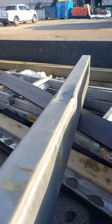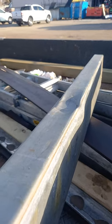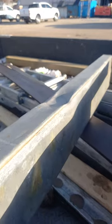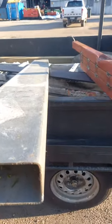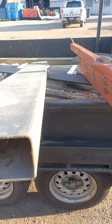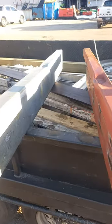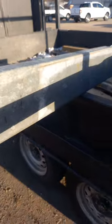What I did was I stuck it in a press to see how much it'd move. We put 15 ton on the top of this, and as you can see she's really bulged out the side. And if we look down the rail it's actually curved — so not too much, but that's the case. That's just a standard lump of RHS.